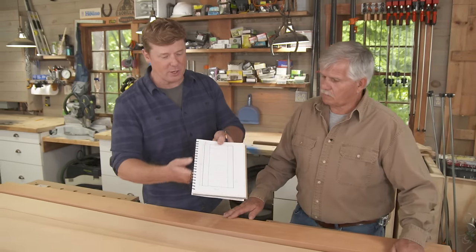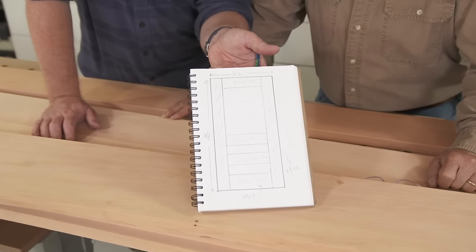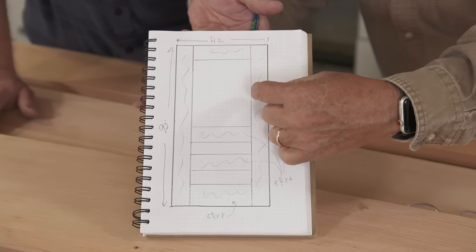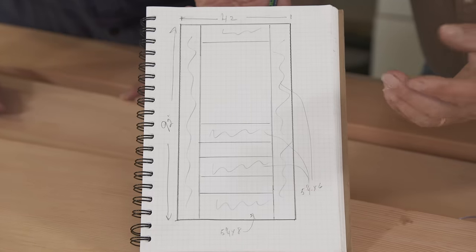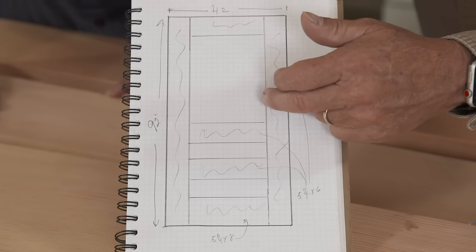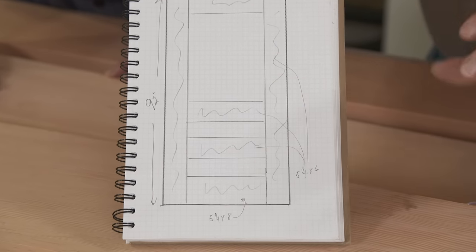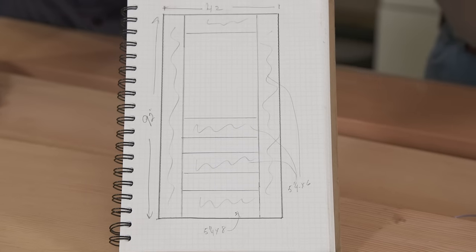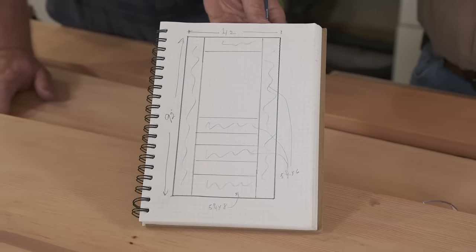The first thing you've done to help us make sure that this door stays straight and true is your actual design. Well, the design is, this material is much wider. The stiles and the rails are much wider than a standard screen door that you would get off the shelf. Other than 3 to 3.5 inches, these are 5.5 inches, and the bottom kick is 7.5 inches. The idea of that gives me a lot of meat at the connection to lessen the chance of the door sagging or racking over time.